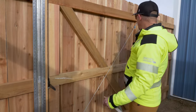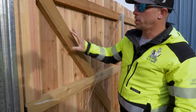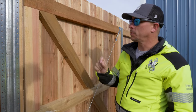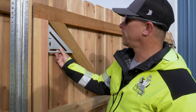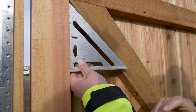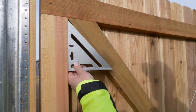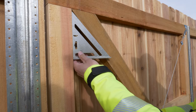Because this gate is hinged over here on this post, anything that is solid needs to be under compression. There's one other key thing to think about: we've got to keep this angle under 45 degrees. If we were out here we would need to think about a different way to brace this gate, but since we're under 45 degrees this brace is a good brace.